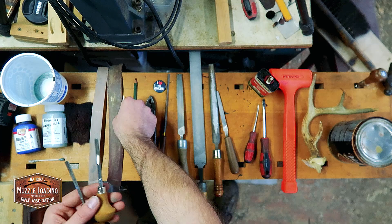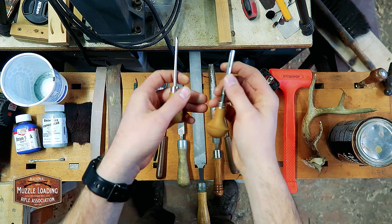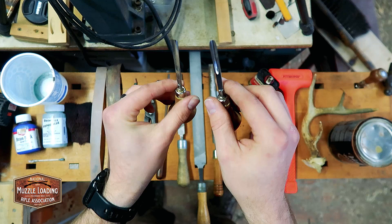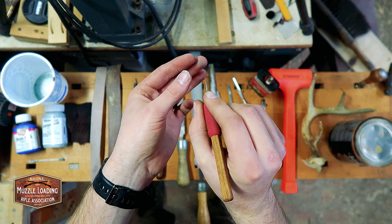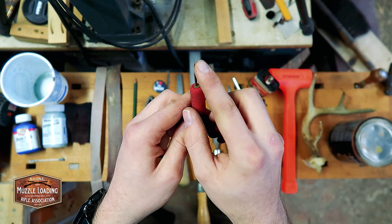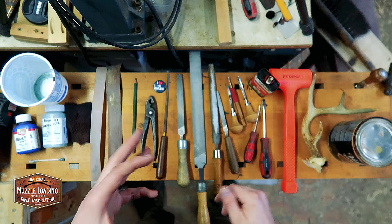A pair of pliers is going to be nice. I also mentioned a couple chisels and a small knife. These are some little palm chisels — both are just differing radiuses, one pretty shallow and the other pretty steep. The only place you're going to use these is if you have any spots needing inletting; for me the trigger guard needed a little work. Having a couple of curved chisels like this can really help make that inletting easier. This really small knife blade is also going to be used for inletting — it lets you trace a part onto the wood stock to know exactly where you need to cut or extend your inletting. Using a pencil works too, but it won't be as precise. It's a really thin, narrow knife, kind of like an X-Acto blade — a nice thin blade to go around parts without removing too much wood.